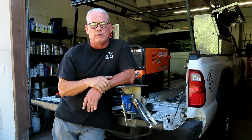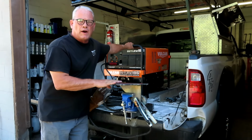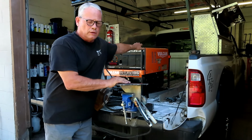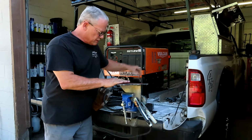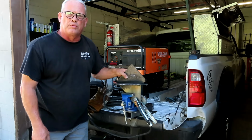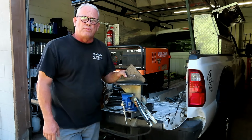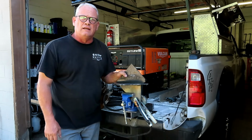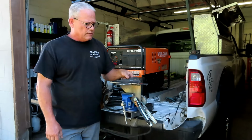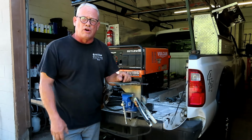But one of the regular subscribers requested a video of the Vulcan Outlaw 195 actually being used. So I've got some quarter inch plate and another quarter inch plate. I'm going to run some 3/32 6010 at 60 amps and some 3/32 7018 on top of that at 90 amps. So let's get started. My shop is on a busy street, so if you hear some cars, just overlook it.